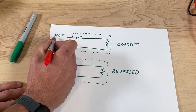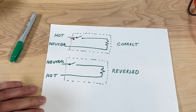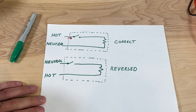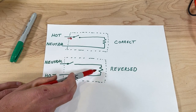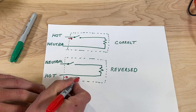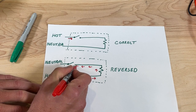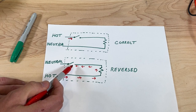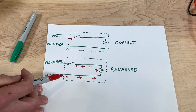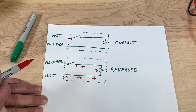The hot side would then be connected to the switch. The switch is open, so the hot itself is not going to go anywhere until that switch is closed, and then it would pass through the resistive load to create heat or whatever the device is doing. When we have that reversed, we have our switch and our resistive load, the switch is open, but because the hot side is connected in reverse, now you have the hot actually connected all the way through. It will not turn on the device because the switch is open, but your hot is connected all the way through that device, which can create a safety issue or can reduce the life of your device.